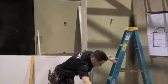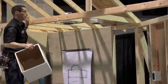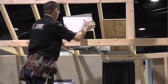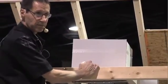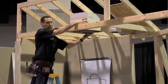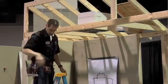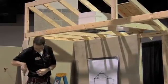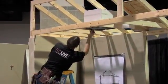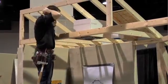Once the drywall is hung, we want to be able to seal this box to the drywall — just like those outlet boxes — to totally isolate this ceiling light. An easier way to do this is to talk the customer out of putting these lights in. They're very popular; it's not unusual to have a hundred of them in a house. I try not to have any in my new house and I still have probably 30 because they're nice, but they are air leaks. I actually have to cut the drywall a little bit around each one of these legs on the light, about an inch, so sometimes I'm up in the attic doing this work.